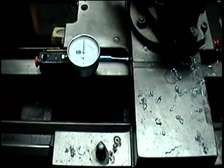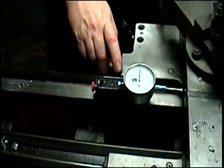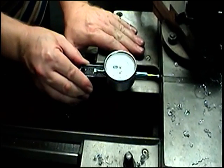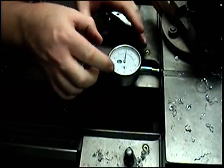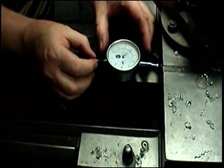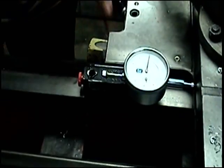What's the mistake I just made? I didn't leave any room on my indicator. I'm going to go in how far? 313 thousandths. So I've got to make sure I have at least that much remaining on my indicator. I'm going to push it in about half an inch. I'm on the fifth zero — I'll reset my zero. There we go, now I've got plenty.